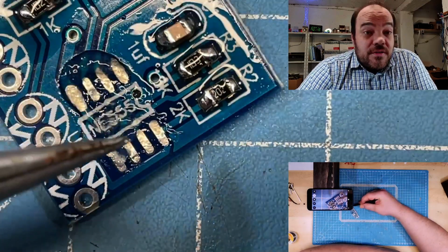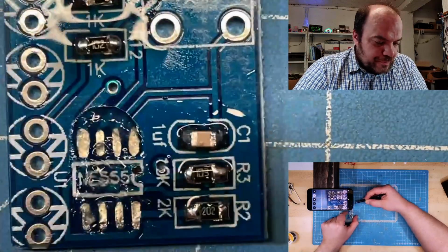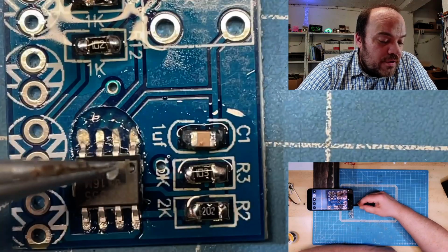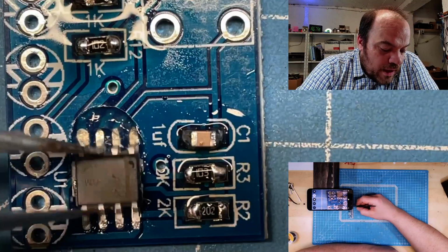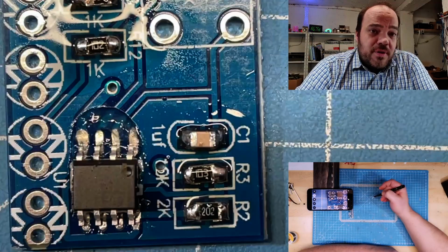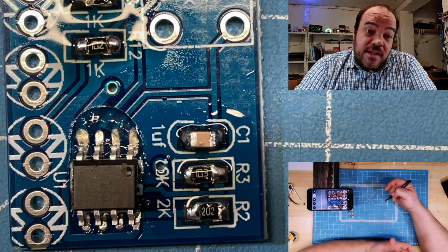We can still see on the silk screen the little notch here, and this corresponds with, in this case, a dot on the chip. Otherwise, if I put it in a different direction, it would be wrong and the chip will explode. I know some of you want to see it explode, but not in this video, maybe in the next video.